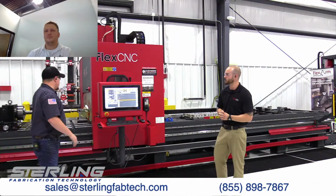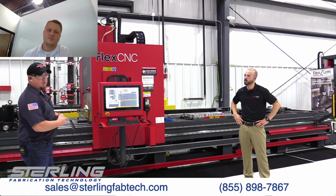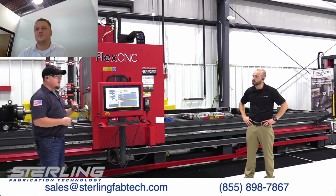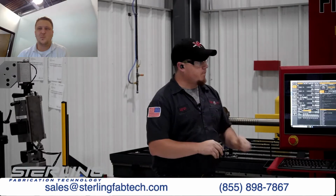Yeah, so over here on the left side of the machine, we got our 4th axis set up with a 2.5-inch tube that we're going to drill some holes in. I know Isaac's going to be running some B-roll while this thing runs. We got different rotations, and like I said, we're going to be drilling some 9/32 holes into this tube. Let's get things rolling, man.